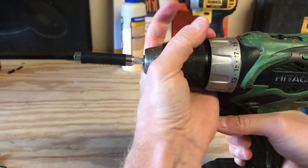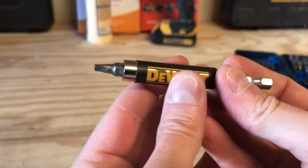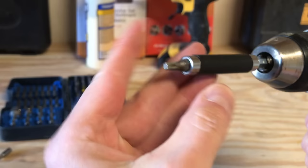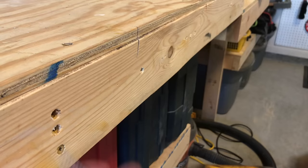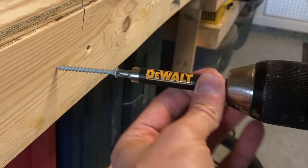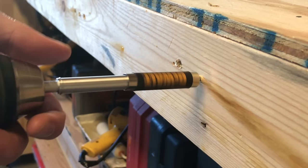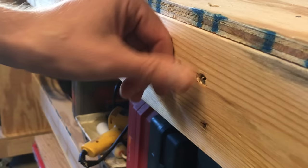The drill bit guide prevents these problems. It has a shank that chucks into the drill, then a pocket for the bit to sit in, and a metal sleeve that slides up and down the shank. You can put most any kind of driving bit into the end, then slot a screw onto the bit and put the screw point where you want to drive it. Throw the sleeve over the screw and start spinning. The sleeve traps the screw in place, keeping it upright through the entire drive. As the screw sinks in, the sleeve slowly retracts itself until you're fully embedded.